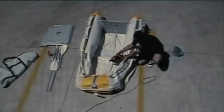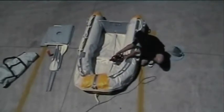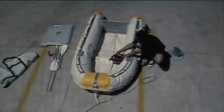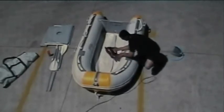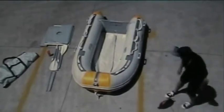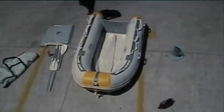Okay. When you're using a blower like this, you need to be in the free flow mode. Once it's fully inflated as it can be, you move quickly to reverse it by turning the little central nipple in the valve into the one-way mode, otherwise you lose the air. That's what Bruce is doing just now. Okay, so there it is. It's overinflated for fitting the floorboards, but it does illustrate how quick and easy it is to do that.